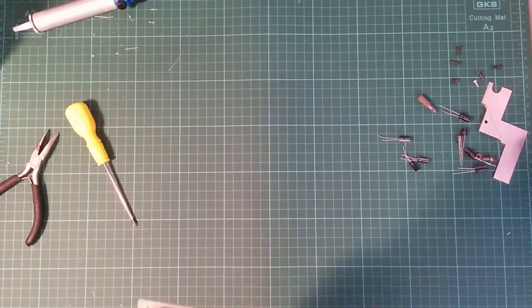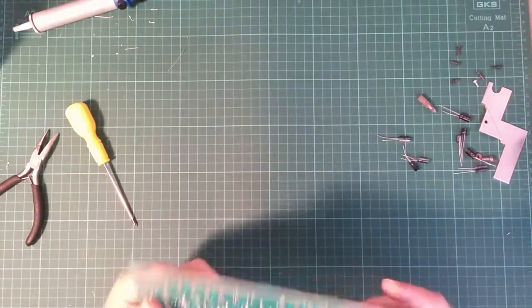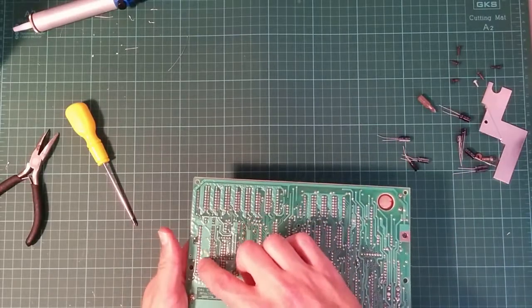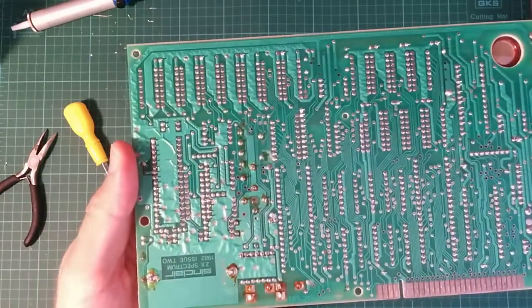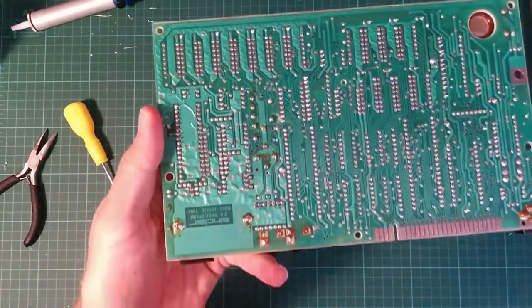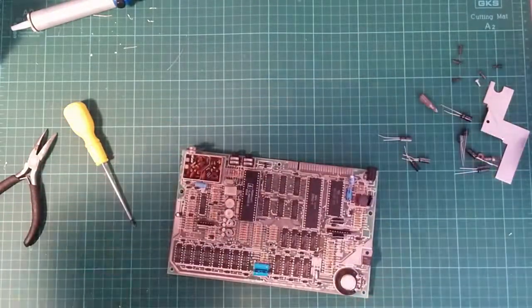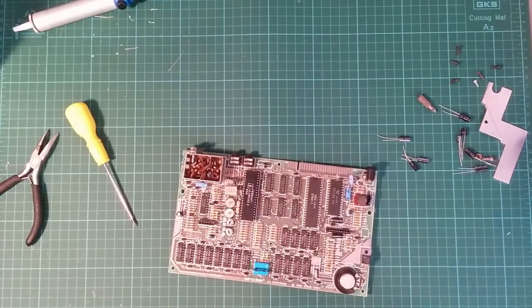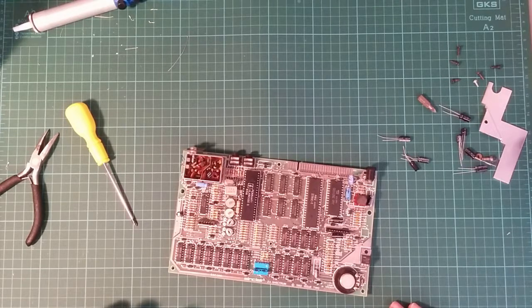Right. Now. Yes, interesting fact about these boards. This ripple effect. Can you see the ripple effect over here? That's not a fault in the board. It's because after the board was made, they reflowed the whole thing with a fairly thick layer of tin for reasons. And it just leaves a layer about, you know, half a mil thick or so. It's a bit uneven, hence the rippling. Actually getting there, you know.